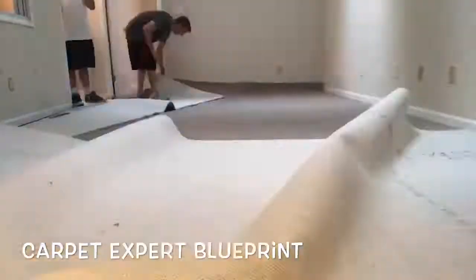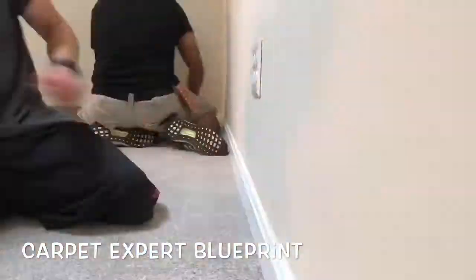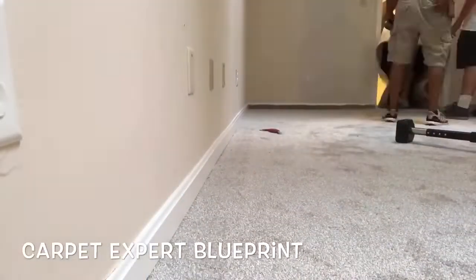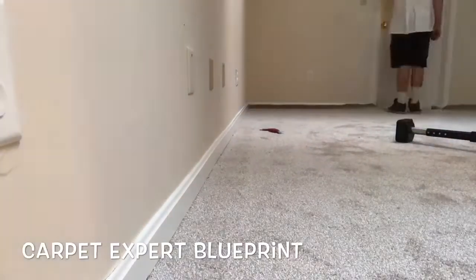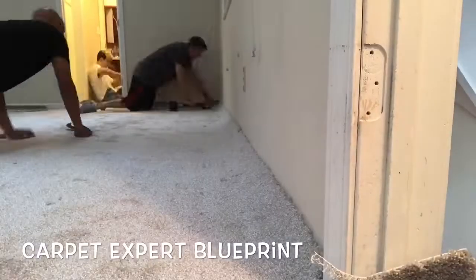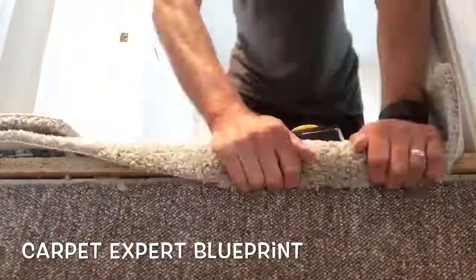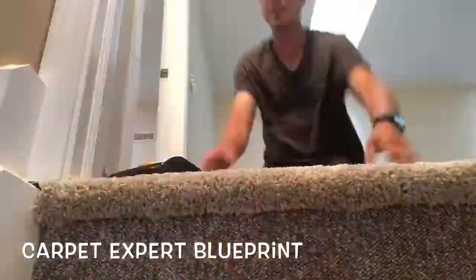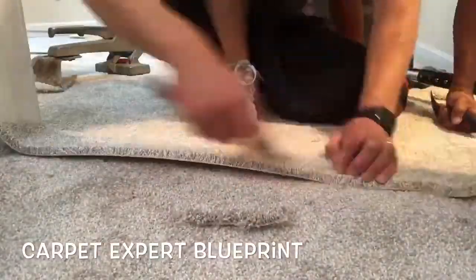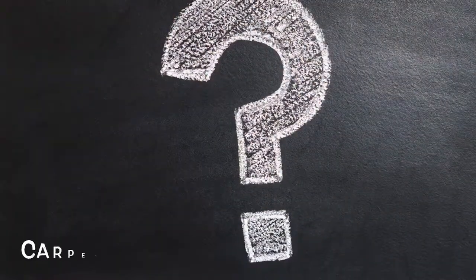Here is the big room — we've got a 24-foot drop room, meaning there are no seams in it. Setting this up the same exact way: do your set wall, then stretch the opposite wall on nice and hard, then do the side wall, and then there's the hard wall as well. Here's where it gets interesting — you see that it's about a half inch short, so I lock the crab stretcher onto it to go ahead and wrap it over the edge, making sure I've got the stretch nice and tight. Now I'm cutting and burning the final seam and I'm good to go.